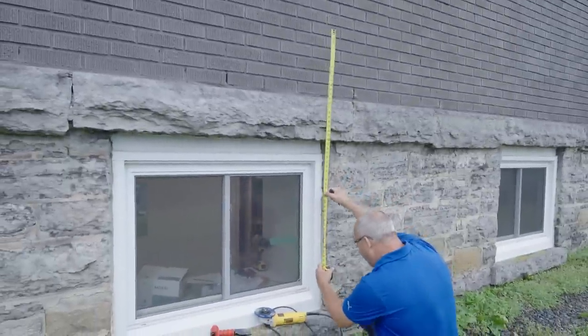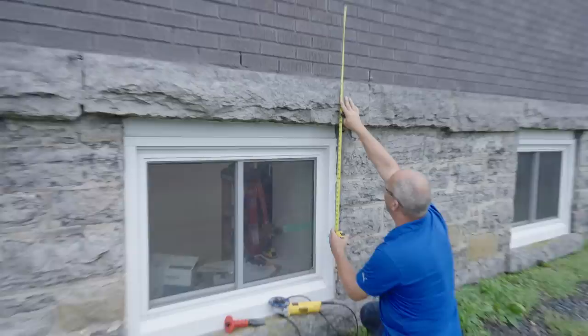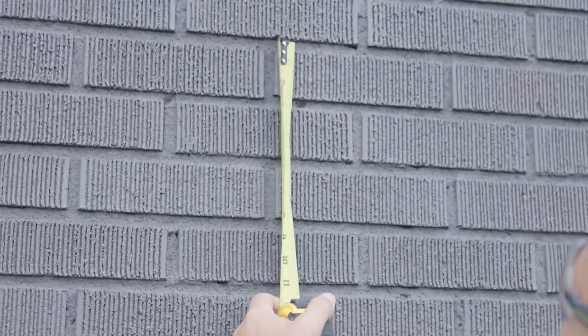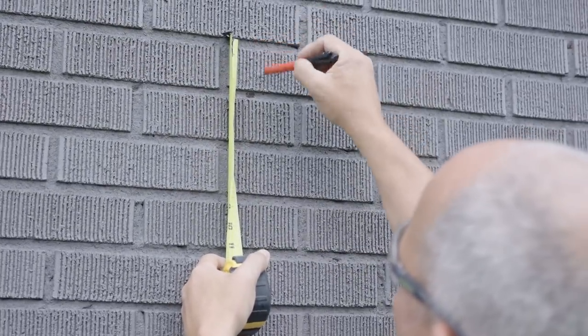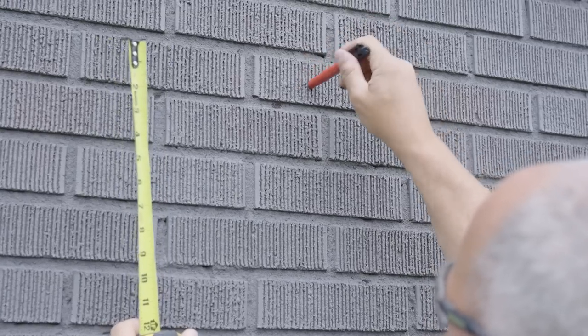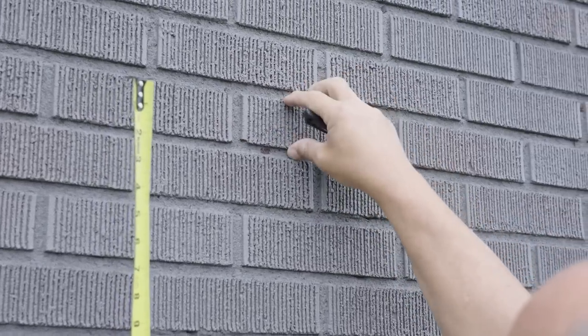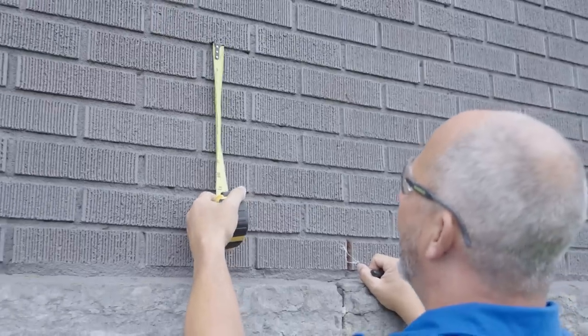Let's get 47 on my tape line. Our brick mortar-to-mortar is three inch, and I can get by getting one brick out. Our fan exhaust is only three inch, so I'm just going to take out here and here — that'll be my spot. Piece of cake, because I can get a three-inch pipe in there like that.